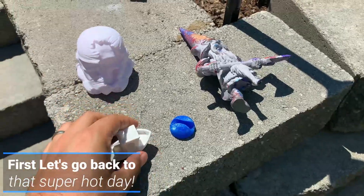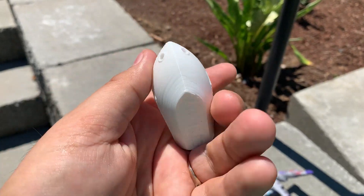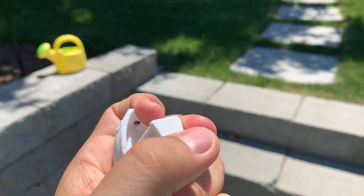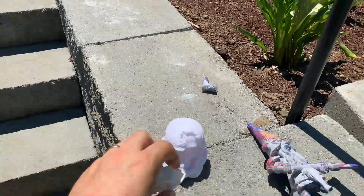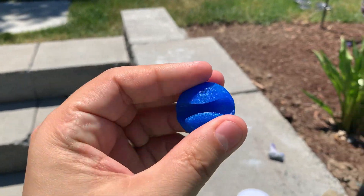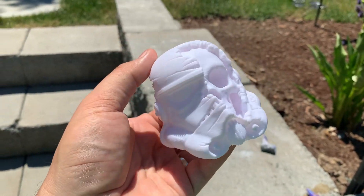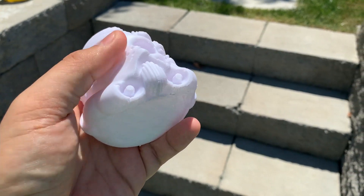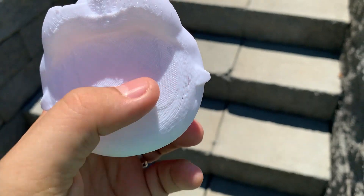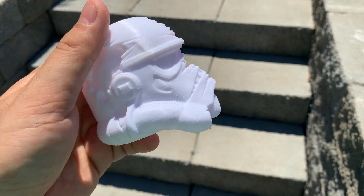It's 120 at the hottest part of the day here. Right now this is the benchy print — it's not a super clean print, but we're seeing no distortions or anything. It's not feeling melty at all. It's 104 Fahrenheit right now. This wire holder is not bendy at all, and this was a 30% infill. This 5% infill death trooper skull — I'm not seeing any warping. I'm pressing on it. Now the bottom of this is very thin; you can see where a layer actually bled through on the print itself. Knowing that it's thin, I expected it to break or be damaged, but everything on this looks fine.